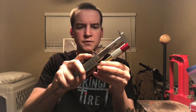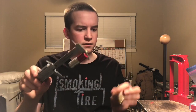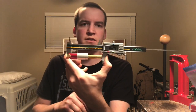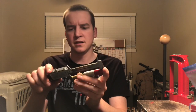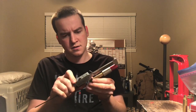You zero your calipers up against the base of the comparator, then get your brass zeroed — which can be a little tricky. Let's check the brand-new Hornady brass after full-length sizing. It's still shiny in the primer pocket and case neck. The headspace is reading 1.624 to 1.625 inches.